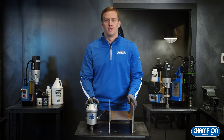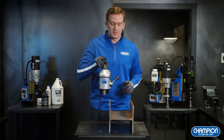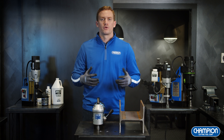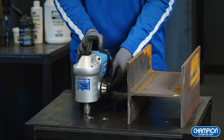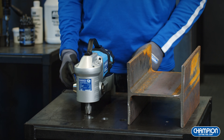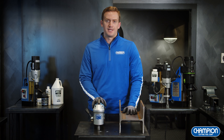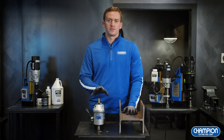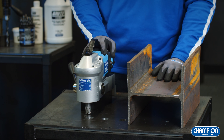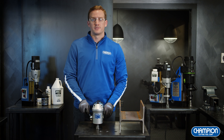Here we have our RB30 Little Brute. This is our low profile, lightweight unit to get into those tough-to-reach areas, like tight I-beams, underneath a truck trailer, or inside a wheel well. One of the great features of the RB30 is that you can easily move the handle from one side to the other. The drill capacity on our RB30 is 1-3/8 inch diameter by 1-3/16 inch depth. Surprisingly, for such a small unit, it has an extremely powerful magnet with a magnetic strength of 3,300 pounds. I've already applied our Brutelube wax to the cutter.